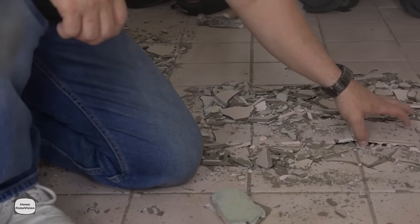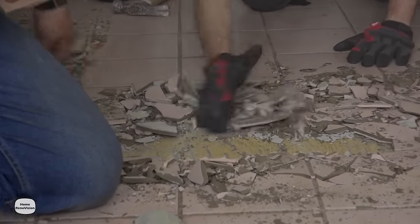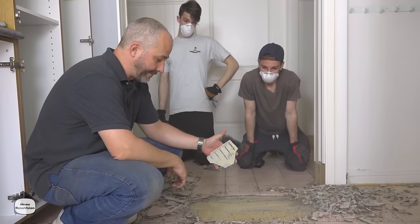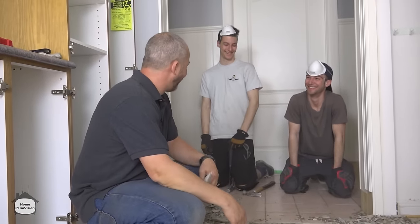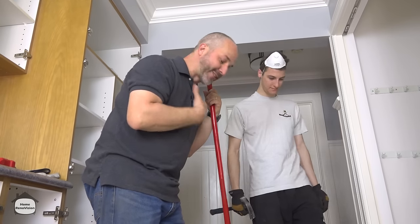This is a great time to explore their installation technique to see if we can learn anything. Classic direct bond — we have a lot of cement, they used a nice thick trowel, you can see the trowel grooves right here, great contact with the tile, but direct bond on plywood. This is why you shouldn't do this: most guys don't take the time to wet the plywood while installing their tile, so it doesn't actually bond to the plywood because it's too dry. I love it when people don't install tile right, because it makes my job so much easier to remove this floor.